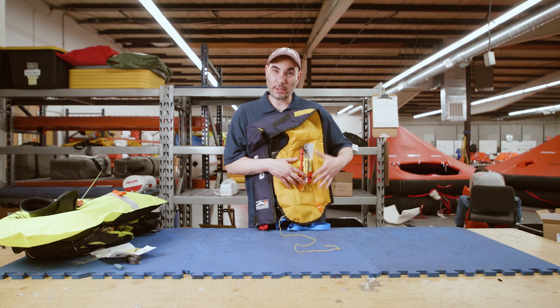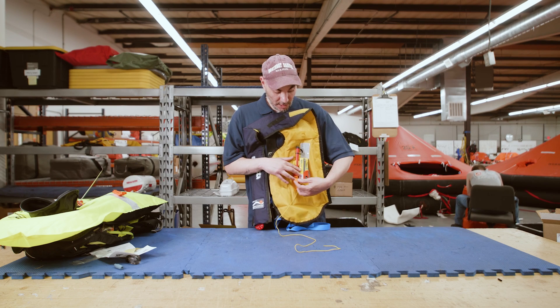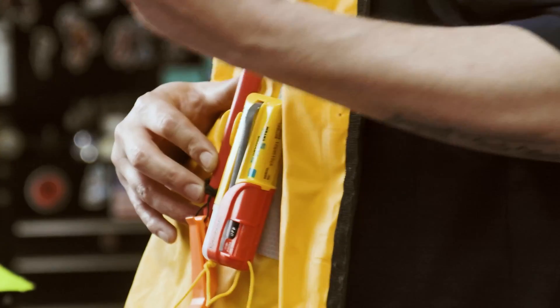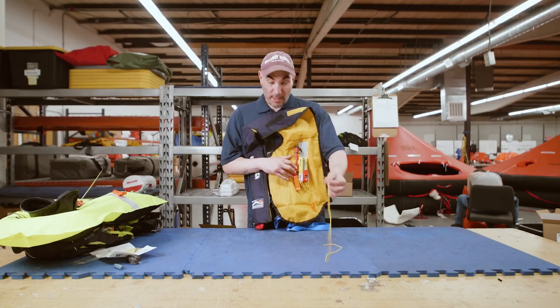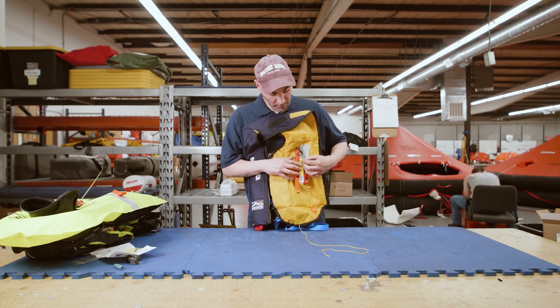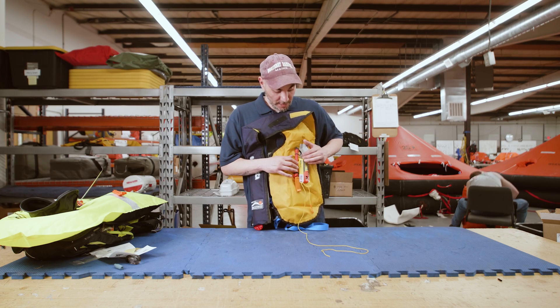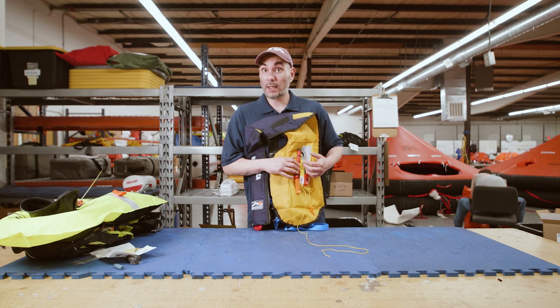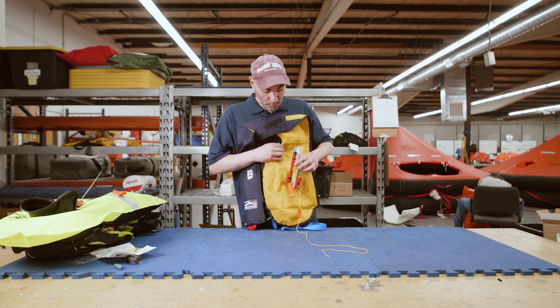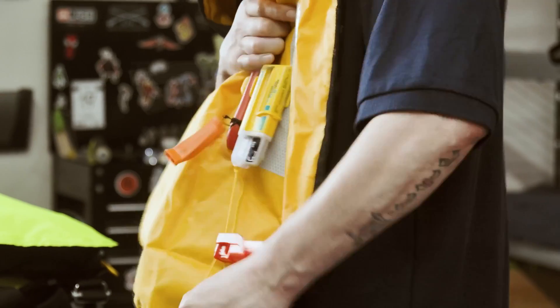So make sure your AIS is set the correct way. Make sure this is out, not in the locked position. Make sure you can see the face of the AIS unit so when your antenna flips out it comes straight out that way. And even if you weren't using this to automatically pull, this is still a safety lanyard — if you leave it attached to this side and tie it off, if your unit falls off the oral inflation valve you won't lose it in the water.